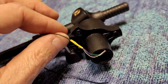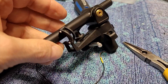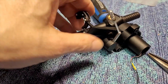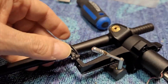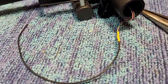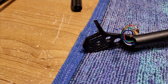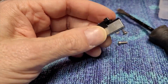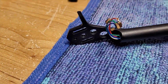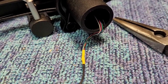So here's where we're at: got our wiring through, our bearings back on top and bottom, nice motion left to right and up and down, bearings are taut with no slop. We are ready to remount this arm back in the turntable. Before I do that, I'm going to reinstall the audio cables. Luckily I removed the cartridge because it was banging around a little bit — it's just your standard AT3600, the Rega Carbon. I think we've got a success here.